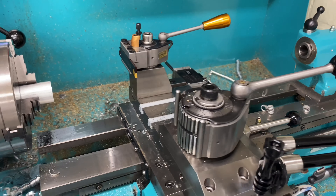In terms of the project, I enjoyed doing it and I'm quite happy with how it's turned out. I didn't go for the same design as some of the other rear tool posts that you see around - I wanted to keep the footprint quite small. Some of the other designs use both T-slots here, but I've just gone for the single T-slot, which gives it a smaller footprint but it's really solid. I think a parting off test in stainless steel will be a good thing to do - that'll tell me how good it actually is, and I'll do that next.